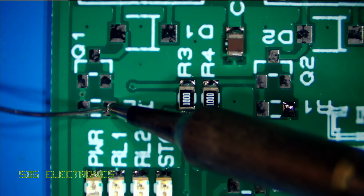So that was pretty pleasant to use, absolutely no problems with basic soldering. I wouldn't expect it to struggle anyway, but that's what these PCBs look like. We've got the pin header onto the main board, some status LEDs, a couple of MOSFETs and some back EMF diodes for the two relays. And then we've got these interesting terminal blocks. I was out of space, managed to find these on RS, and that just handles the problem where the PCB isn't quite wide enough for six terminals. I do need both the normally open and normally closed contacts on these relays, so that has got around it. But yeah, absolutely no problem there with some soldering.